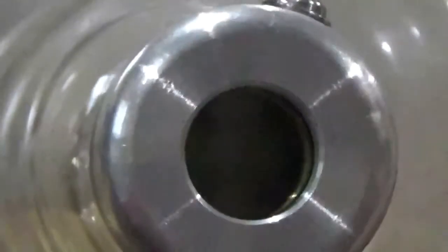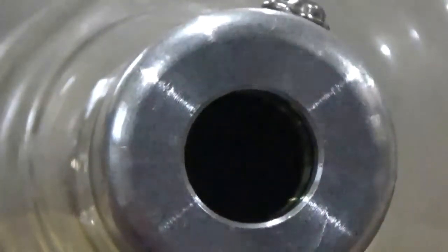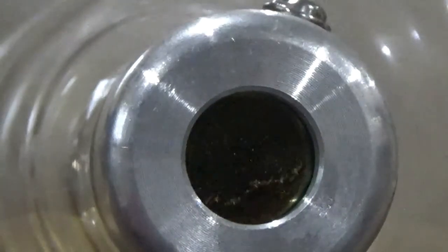The mark has not gone away. Let's go ahead and try this one more time. The mark's a little better. Let's clean it again — brand new Q-tip, more denatured alcohol. Get on there and scrub that mark off. Now if that mark doesn't come off, your mirror is bad inside of your laser tube. And this mirror, as far as I know, is not replaceable. So we got that clean. Dry off the alcohol. It's a lot harder to do inside of the machine. Alright, wow — I think the mark's gone, but we still got some alcohol on there.